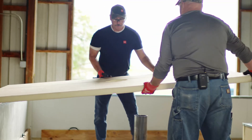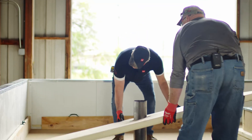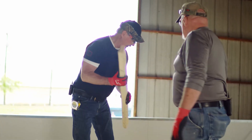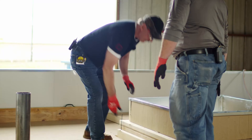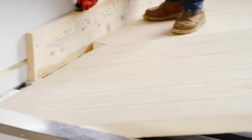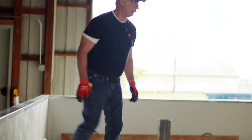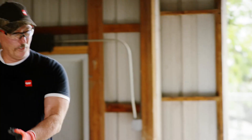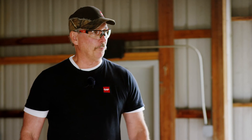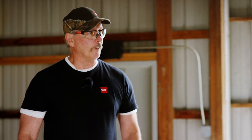This piece is already pre-cut around the penetration. With a two-by spacer right here, we make sure we're staying an inch and a half away from that curb. Everything's tight. Just continue all the way across. If the roof were bigger we'd need more lumber spacers. All we have to do is put some screws and plates in and start low-rise foam filling from there.